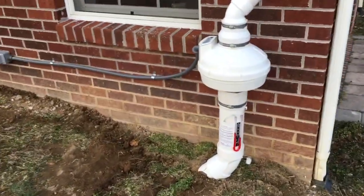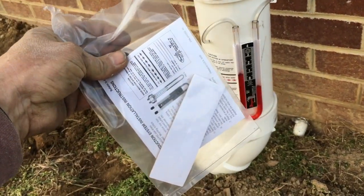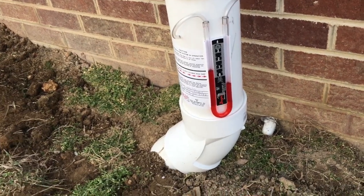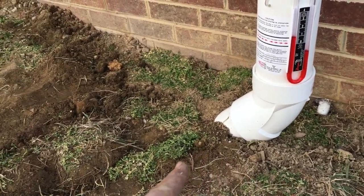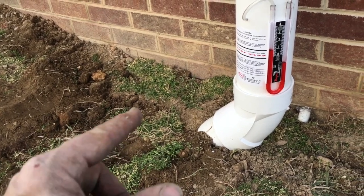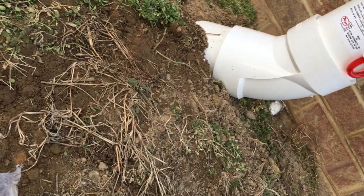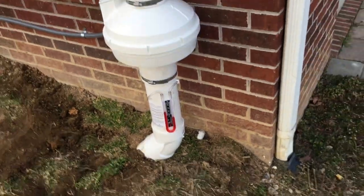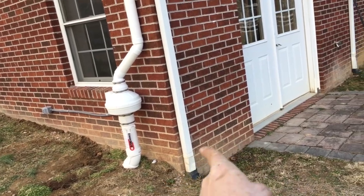I almost forgot two things. When you do a manometer outside, be sure and screw it in. The sticky tape they give you will work forever indoors, but outside, forget it — it'll be toasted in no time. Also, cell phone cameras are terrific. What I did was put the camera down inside the pipe and took a picture to see if it was being obstructed by all that expanding foam I used to seal it in. Definitely want to double check on that, because that expanding foam can really get away from you. The last thing you want is to have it clog up the inside of the pipe as it's stubbed in there.